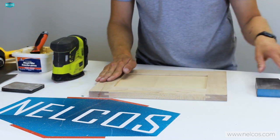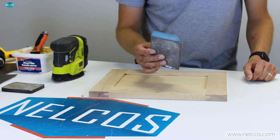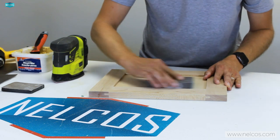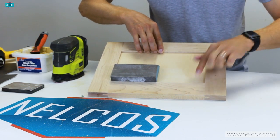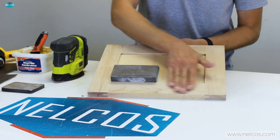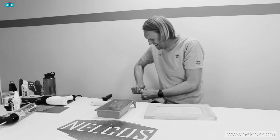I still need to get to the inside of the doors and inside corners. I like to use a little sanding brush with a 45 and 90 degree angle and manually get into those inside corners, because we want to make sure all corners are sanded so the primer will accept the material. Always feel it with your hand — eventually you'll learn when everything is prepped and ready.